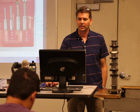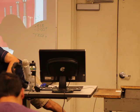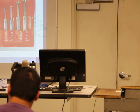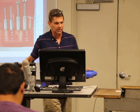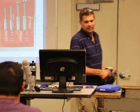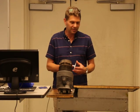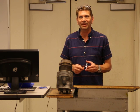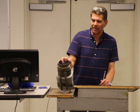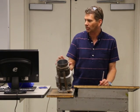There's your dial caliper. Now, T-gauges — I say they're my best friend sarcastically, because I don't love T-gauges. There are better tools out there and they can be very frustrating. That said, you guys seem to be the best class I've ever had at using a T-gauge, and I'm very serious about that. There are some tricks: notice how the silver set is positioned — you want to set it this way, not right next to the table.